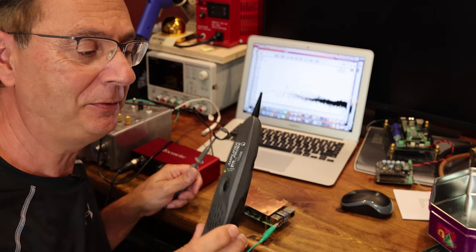What if we put a shield on top? A little better, but not a lot. Now keeping the shield and grounding the Raspberry Pi directly — that made a big difference, though still noisy up close. Then grounding the plate as well — a lot better. At a little bit of distance, it makes for a good improvement. This probe is a crude but easy way to measure things without complex setups.